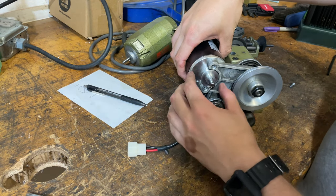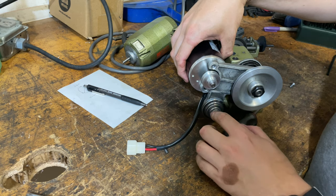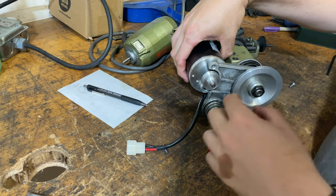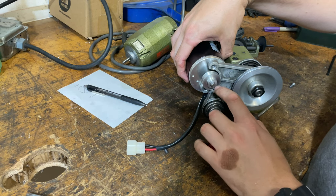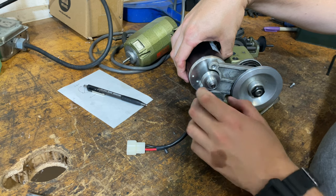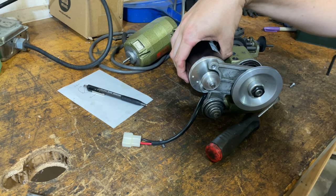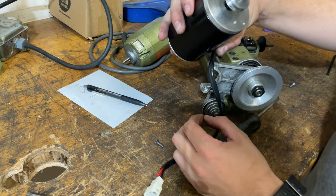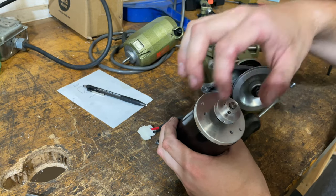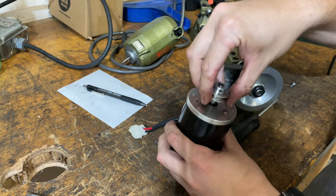The reason I chose a 31 millimeter pulley is because it's the same as the middle size step. This motor is a little bit slower RPM and I usually run in the smallest pulley slot, so by going to a larger pulley it should get it closer to the normal Unimat motor speed. I think what I'm going to do is take this all apart to see how we want to put that extra screw hole in.